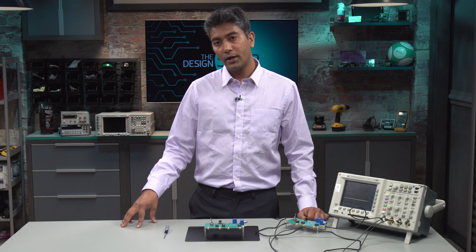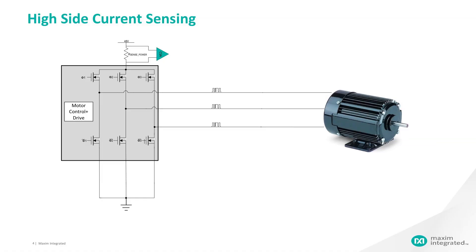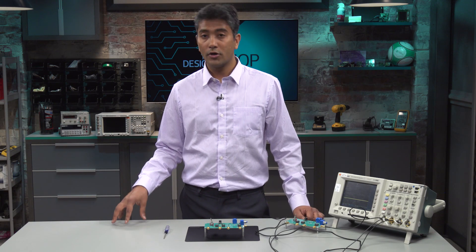The other issue is that this technique does not indicate faults. The next technique is the high side, where a current sensing element is placed on top of the high side switching element. The issue here is that the choice of the current sense amplifier needs to be able to handle the common mode levels, which is usually the power supply, which can be about 48 volts and above. This topology can detect faults occurring at the motor, but yet the instantaneous currents going into each phase of the motors are not ascertained.